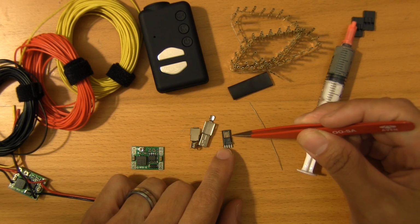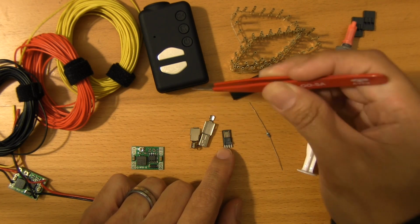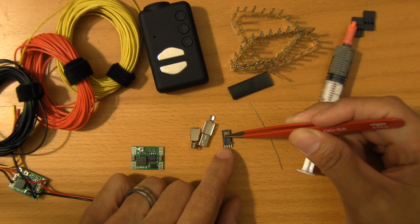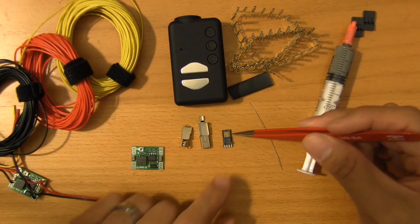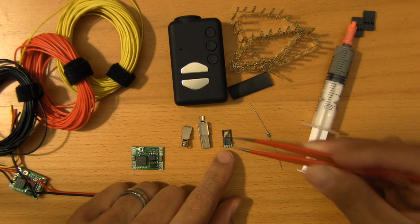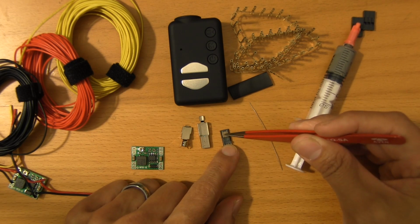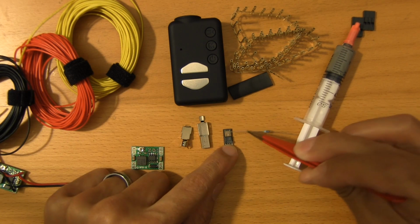So from right to left, it's pin 1, 2, 3, no connect, or at least in the case of the Mobius, the sense line, and then pin 5 is ground. Now, the way the Mobius knows to send video out is that the sense line is shorted to the ground line. So that means pin 4 and pin 5 are shorted, and that's where this lead comes in.